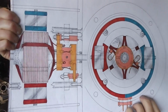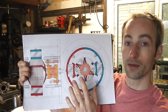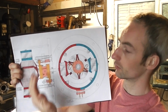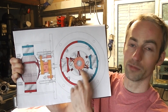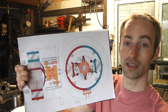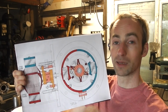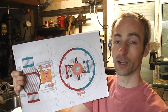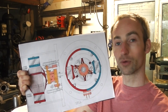This is the most complicated one, and also interesting. It's an alternator. In all the textbooks you will see the motor is very similar, there's a motor as well. You see a north magnet, south magnet, and a bit of wire in between. That's how they say motors work, and essentially they do. But if you crack any motor or any generator open in the real world, you see something completely different. They're all wound in 101 different kinds of ways. This motor here is wound just like you see in the textbooks. That makes it quite inefficient.